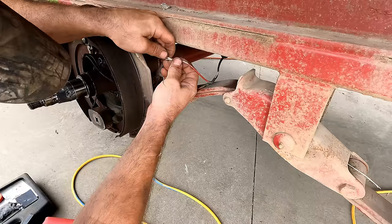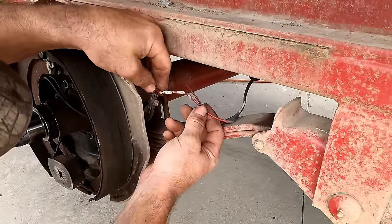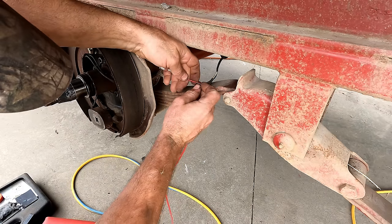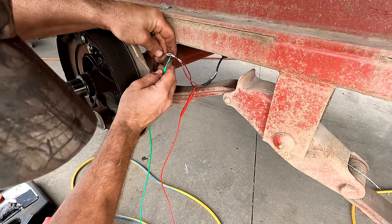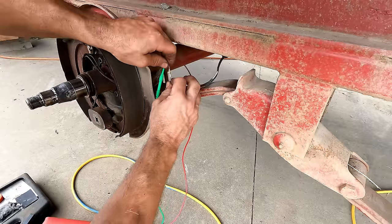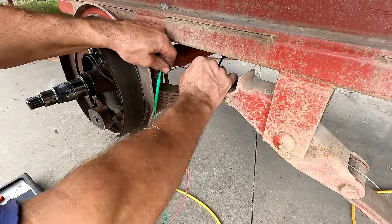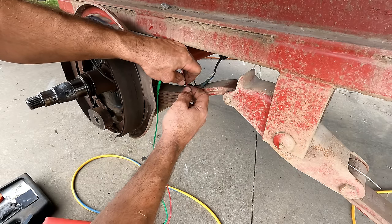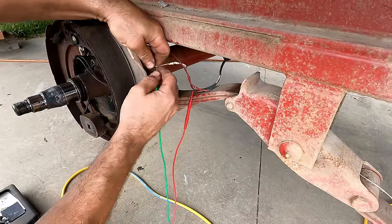I also found this and I'm not sure what did that. Looks a little chewed up, but it doesn't look like it damaged the copper. I think it just damaged the sheath. I'm going to check for continuity across it. Boy, it's hard to do. Well, isn't that interesting? I just lost continuity. So apparently this wire is broken somewhere, I think, unless I didn't puncture it well. I missed on this one. That's what happened.